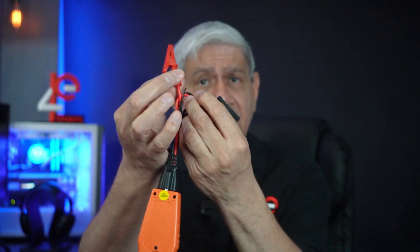They also give you an accessory with alligator clips and a three-prong receptacle. If you haven't put an outlet in yet or you have dangling wires, you can use this to connect up to the hot and the neutral — reversed or not, it still works fine. When you turn it on it will send a signal through those wires to the breaker box. They even give you the batteries: the transmitter uses two triple-A, the receiver uses two double-A, plus a little screwdriver to open the battery compartments. So it's a pretty complete kit.